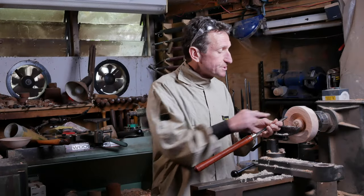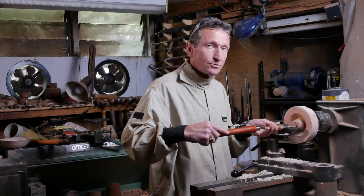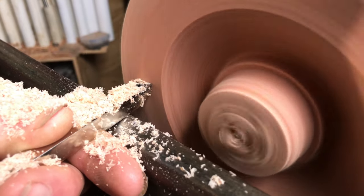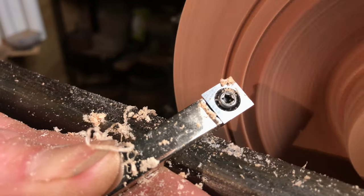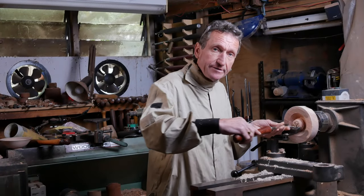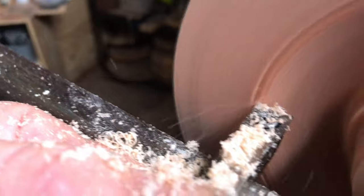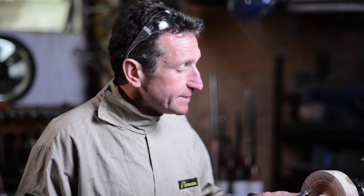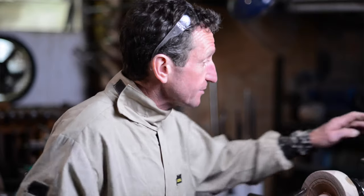The 9001 tool is the square cutter that has a very slight radius on the tip, so it can be used on flat surfaces without catching the corners. The 9002 is the square cutter with nice sharp corners — rather than using it on a flat surface, you'd use it on the outside of a curve, or you can use the side as well as the front to cut into corners, or turn it right around to cut V-grooves. The 9003 is the round tip tool, and it can be used for the inside of bowls, to do curves, or if you want to do coves.